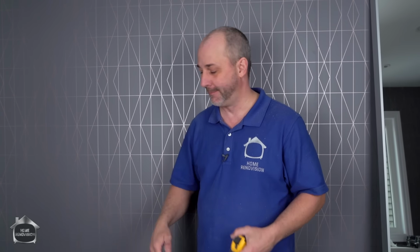And every unit we build will have the same shelf, the same height, fixed in place. So we have the face of the 1x6, the face of the 1x5. And you guessed it, when you build a bunch of these units, you stack them together and you put the 1x2 on the front. Bam, you have exactly the same symmetry and look. And that system can be duplicated over and over and over again.